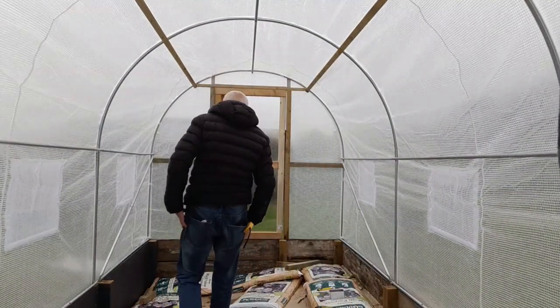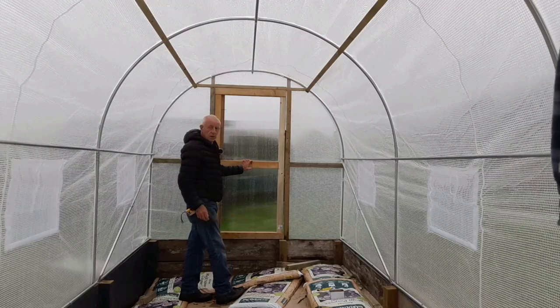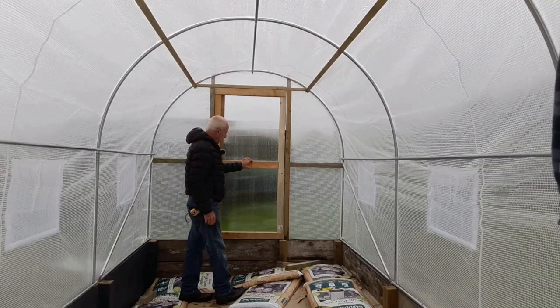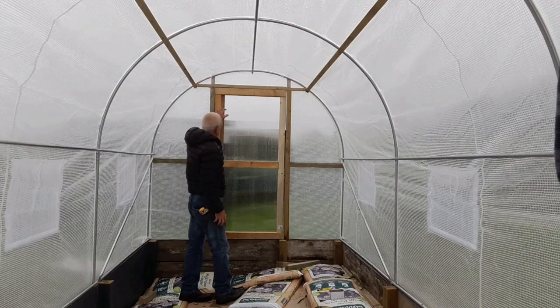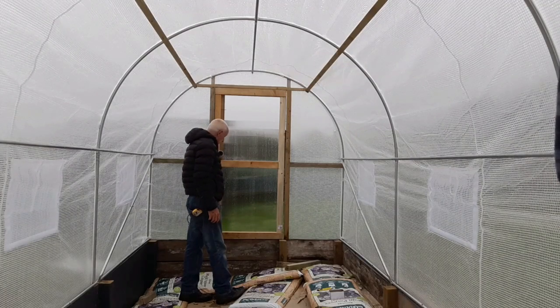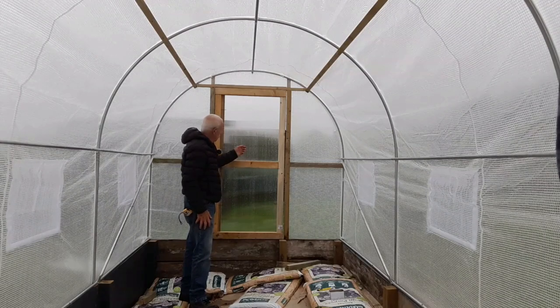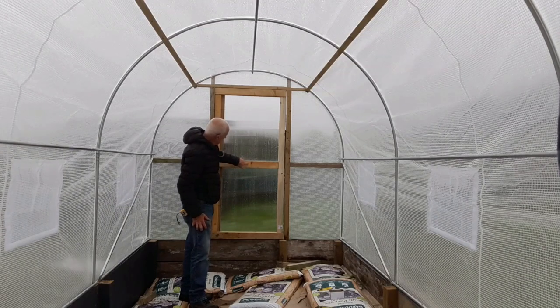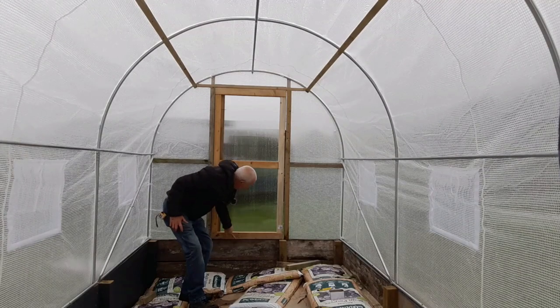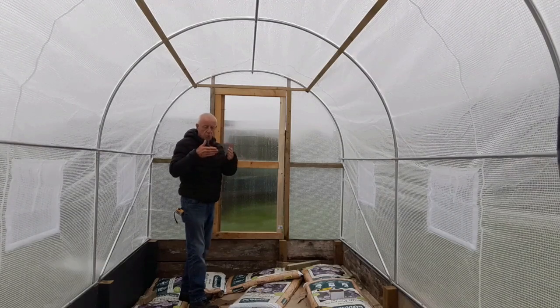As you can see, we finally got this door finished. What we'll do is put a bar on the inside on this one and on the outside on the other. We can now remove the screws that we had holding the frame in place when we were making the door, once we've got our bar fixed. That took a lot of thinking out because I wanted these to be movable. As you can see they're a little bit flimsy, but a single screw — a screw there and a screw there — is going to hold that securely because it's in grooves, it's in tongue and grooved wood.